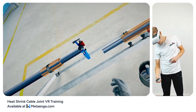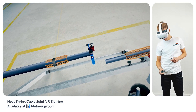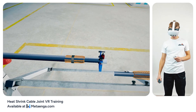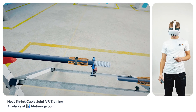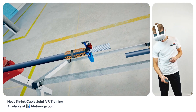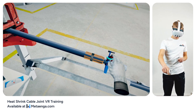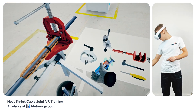On the WS-76 tool, you'll notice a switch. Flip it from the stop position, setting it to forward motion at its first speed. With a firm grip on the tool handle, initiate a rotation to begin removal of the semi-conductive layer from the cable insulation. Once you've achieved a complete rotation, shift the tool's motion back to the stop position and give it another full turn. Now loosen the screw that fixes the WS-76 tool onto the cable and place the tool back on the workbench.